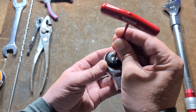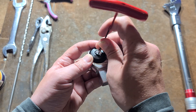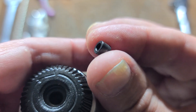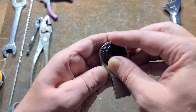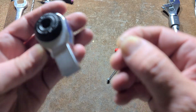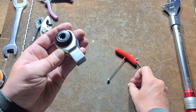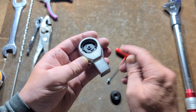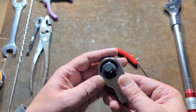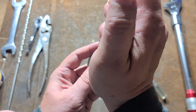I was noticing that even though this is surprisingly enough a little 10.9 fastener, it was loose. It turns out they have a slight issue: it actually has a standoff collar in there that just happens to be a few thousandths of an inch too short. So it causes the reverse lever or reverse knob to lock up. I've been trying to find washers — I have a little acrylic one here, which is like the perfect little washer to stand it off a little bit more. Usually they'll just machine a lip on the head and the reverse switch sits on there with a lip, all held together with one snap ring. So they kind of overcomplicated an already complicated design — you have to remove a snap ring here.